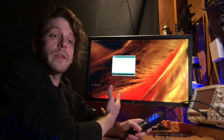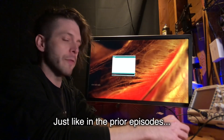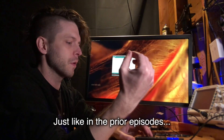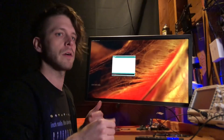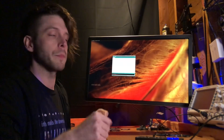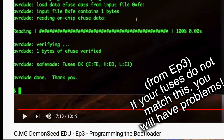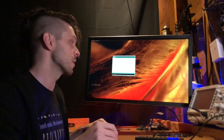If it didn't work, check a few things. Check that you don't have any shorts — there are only four connections that you made, so get out your multimeter and make sure the four are not bridged together. Use some flux to clean it up if so. Also make sure your fuses are set properly from the prior work we did — those fuses are important.